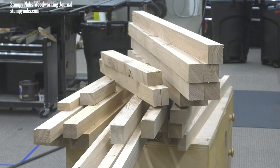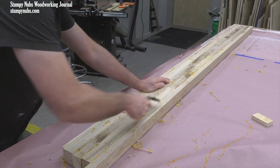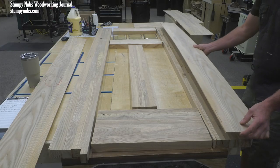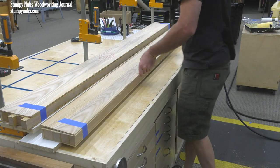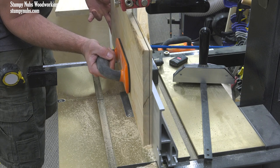This door was a good example because even though it is a solid ash door inside and out, it could not have been made without some basic veneering skills because the inner core was cut into strips and then re-glued together to disrupt the grain and to make it more stable. Thick veneers were then glued to the outside surfaces to restore the appearance of single slabs instead of a butcher block look. Cutting your own veneers is not difficult.